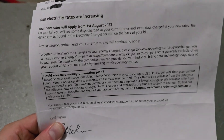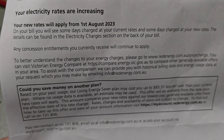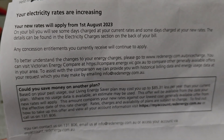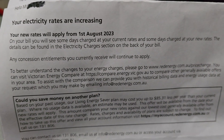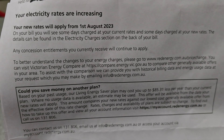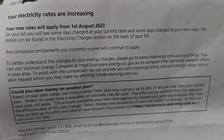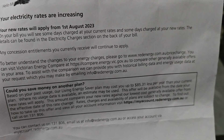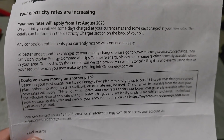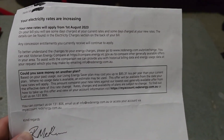Now for the bonus explanation: some of you are probably wondering why someone who owns dual-processor systems and basically every X99 motherboard would go for a single desktop CPU. The reason is electricity — costs are going to keep rising. My current server draws about 105 watts; I'm hoping to get that down to less than 40 watts idle. With Unraid I've already gotten a system down to 25 watts idle, so I'm hoping the total server idle draw will be around 50 watts once this is all done.